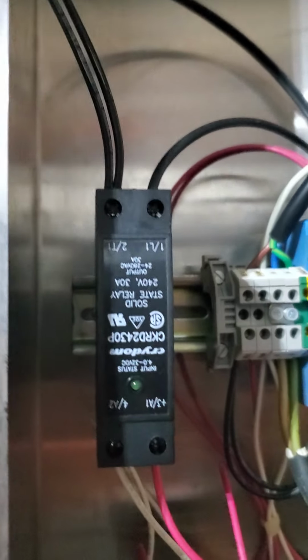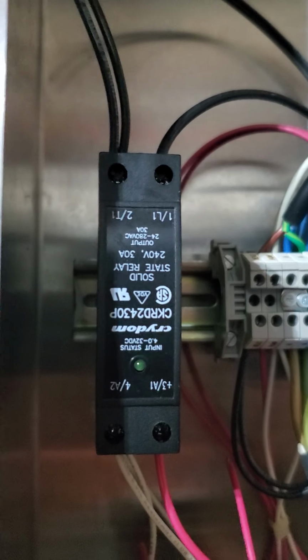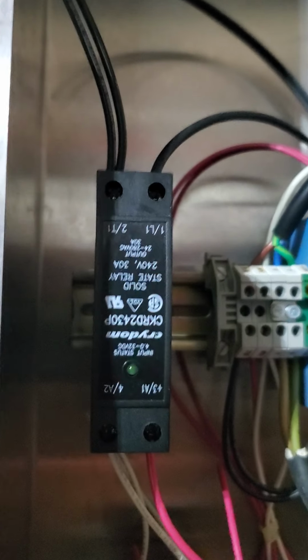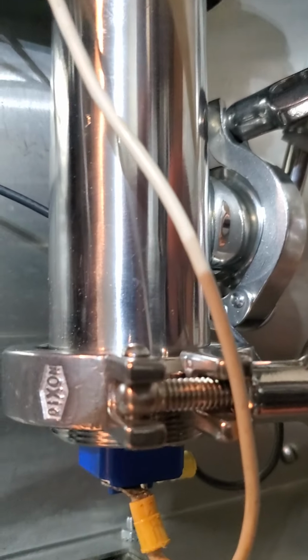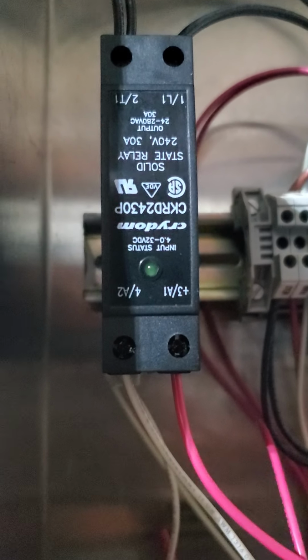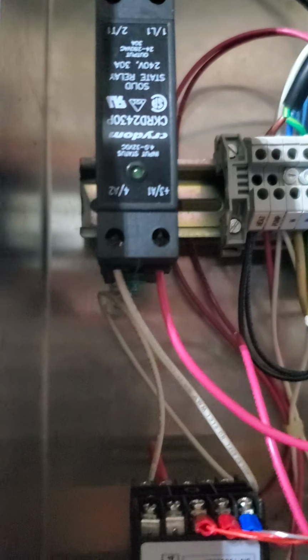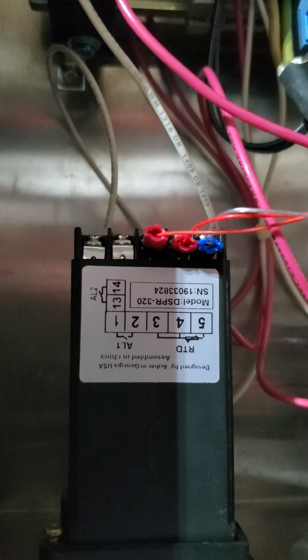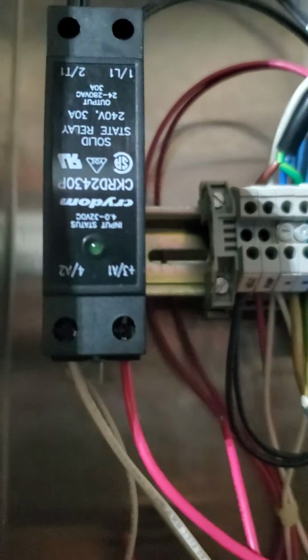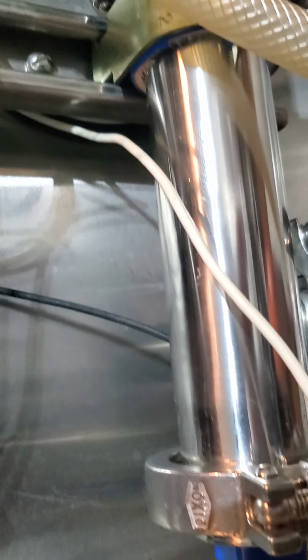And this thing is basically a switch. On the right side it has the heavy duty stuff to drive the water heater element down here. And then on the left side it has a much lower voltage, much kinder setup that wires into here. So this sends out a small signal here, trips the switch, and then fires up the big deal.